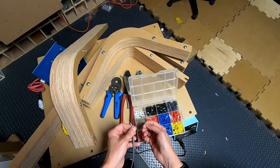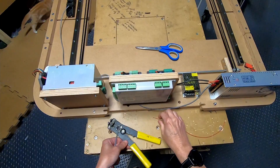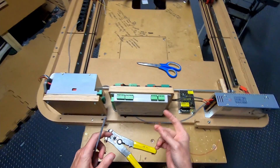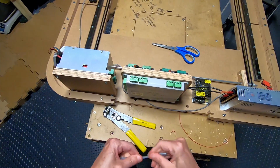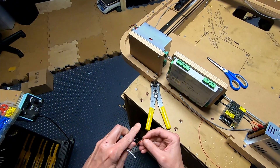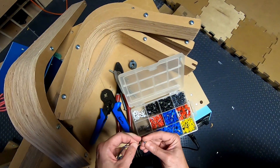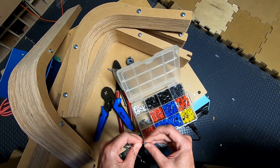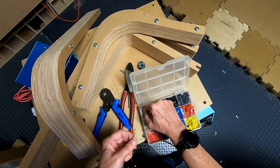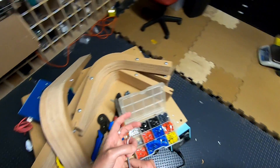I'm using the white wire ferrules since this is about 22 gauge. The other side of the cable will require a jump between the pulse positive and the direction positive. First, remove the insulation and add the wire ferrules. The 5 volts is going to go to two different terminals, so I need to connect a jumper wire. I'll use red for that, and then the white ferrules again for this side. Now we have our cable ready to be connected.